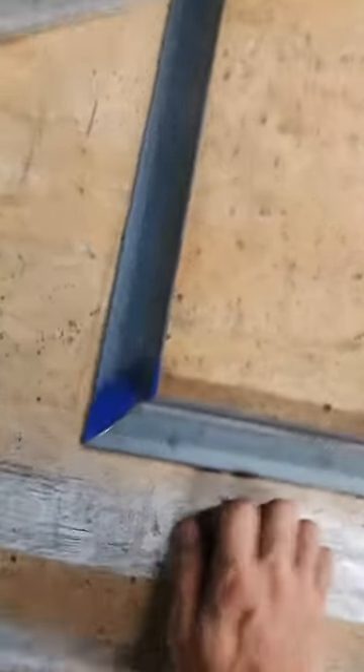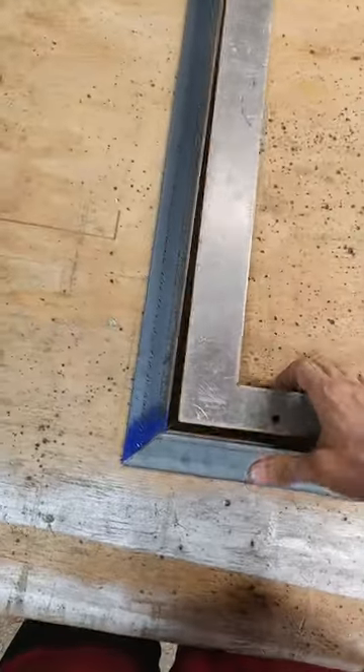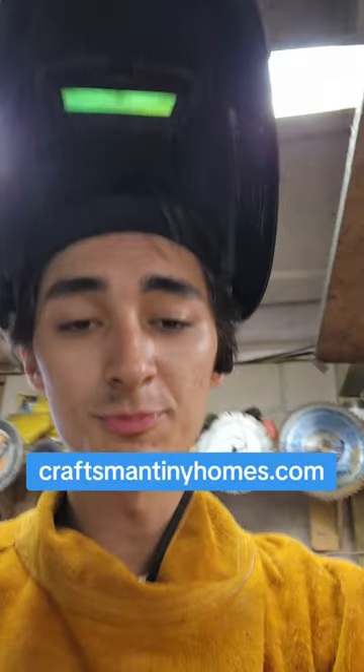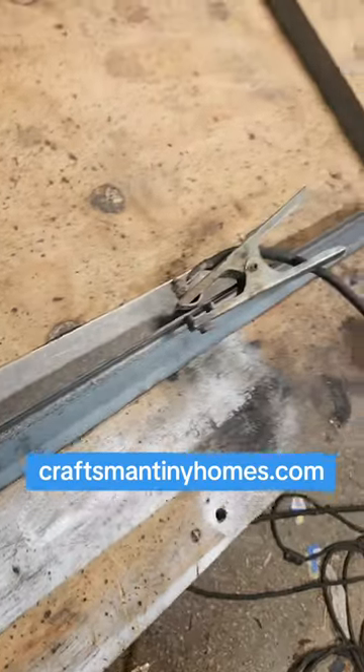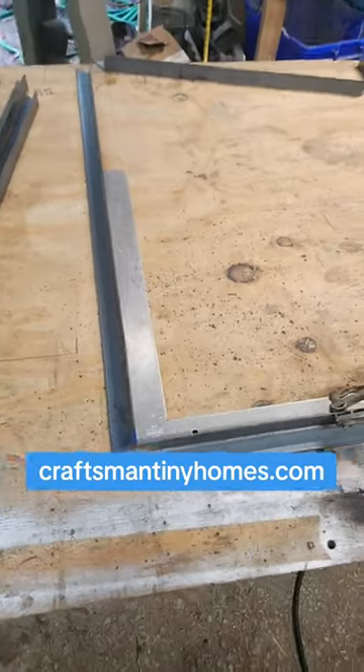The way I start this, I just put two corners together. Now you might look at that right now and be like, just weld it — but you've got to check if it's square. Even though I just put a tack on here, I still check afterwards because the metal warps or just moves. Better to check now than later.